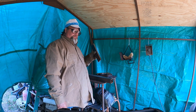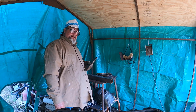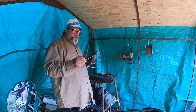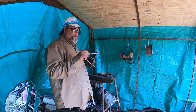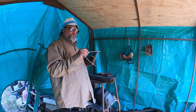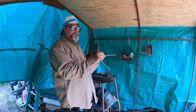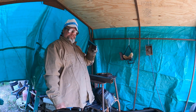It's kind of like TIG welding, but you're keeping the slag out of the way and pushing the rod in as it melts, wiggling it back and forth to the side where you're wanting to penetrate, coming back into the keyhole to fill it up, and then pushing again as you walk back into the heavier metal beyond the beveled area.